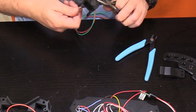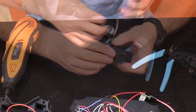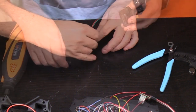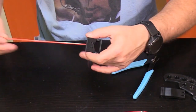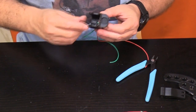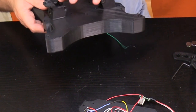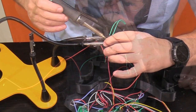The shifter assemblies use a base with a paddle lever that bolts into it. It then uses magnets that fit into holes and use magnetic power to hold them in place. I ended up doubling the amount of magnets, using four instead of two - thicker magnets would have worked as well - and in the end it just made the click a little stronger. Inside the shifter is a three-wire micro switch; I had to use an ohm meter to find out which two wires to use when pressed. This assembly bolts to the back of the wheel and its wires go to the board: tie one side into the ground and give each button a positive post on the board.